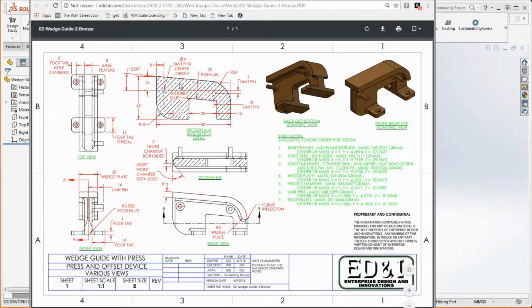And it looks like we can take this side view, the section view up here, and put this all together. That pretty much produces the bulk of the model that we're going to put together. Probably about 40% of it is going to be included in this. And it's just going to be a bunch of sketch items in here, Mid Plane Extrude up to 8 millimeters. And then we're going to put all that into place. So it's going to be our base feature, which other things are going to be placed on.